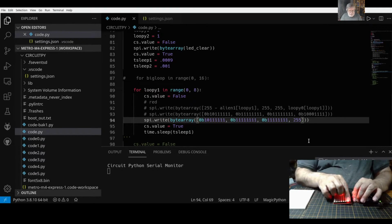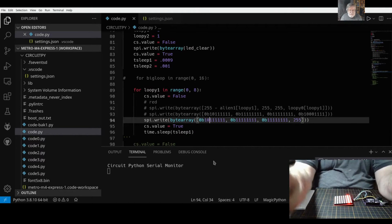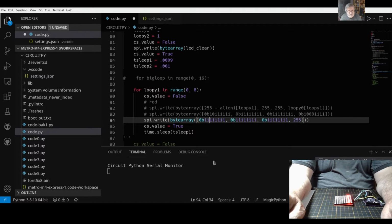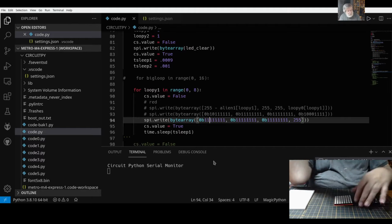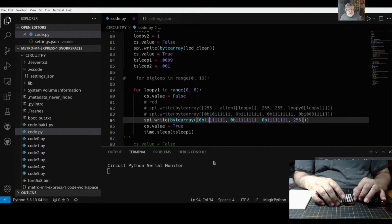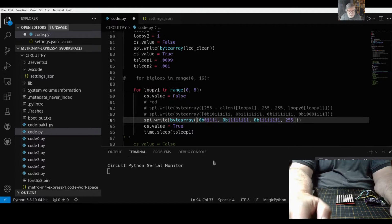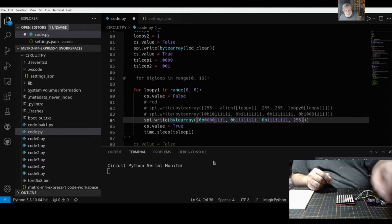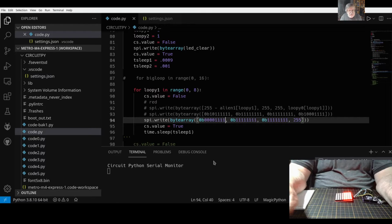Now, that just deals with the row. This does not deal with the position in the row. So over here, right now, we have... and this is dumb too. See, these are all 1s in here. You'd think they'd be all 0s. So if we make them all 1s, we just turn them all off. If we make them 0s, we turn things on. Now, if we go like this, 1, 2, 3, 4 binary 0s, we just turned on all this red.